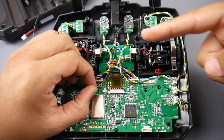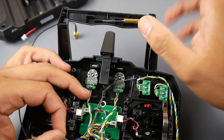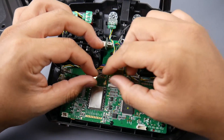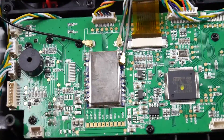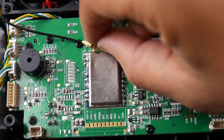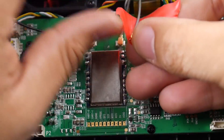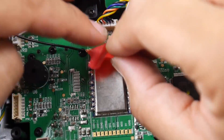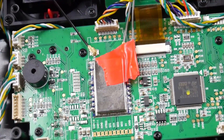To install the mod you have to remove one of the antennas — I removed the one pointing to the side and kept the upward-facing one. Once you remove it you're left with an exposed connector inside, and you want to put tape around it so it doesn't cause a short circuit. It's metal, so touching two of those pads could fry your board or ruin your model. Just grab a piece of tape, cover everything, and leave a little bit of wire out and hold it in place so it doesn't hit a gimbal.